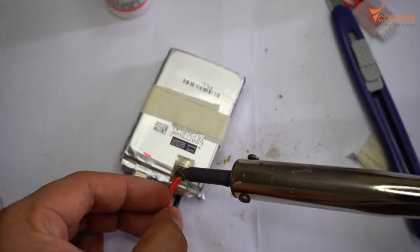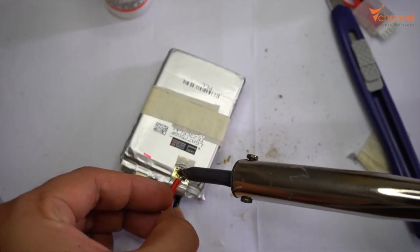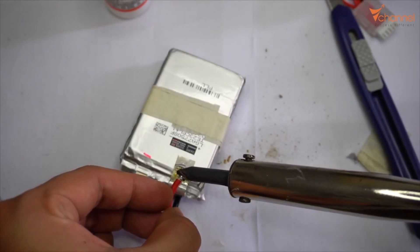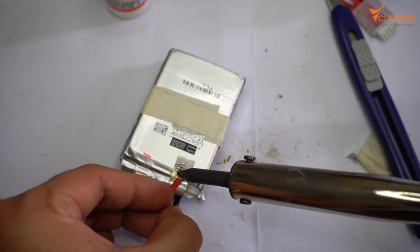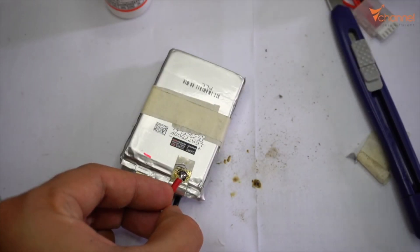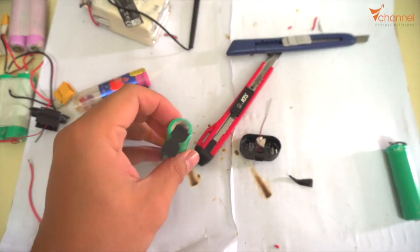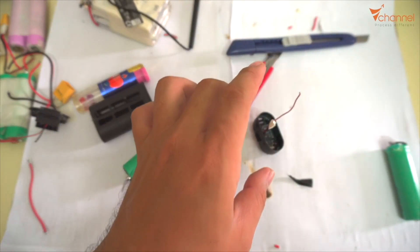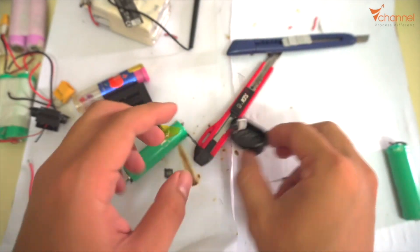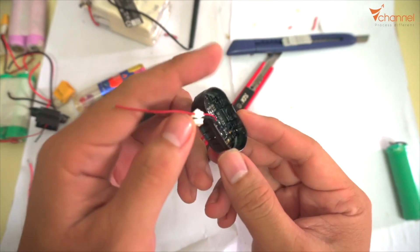If the chip cannot recognize the cell is being picked out, then we put in the new cell. But unfortunately, when it has locked — when we remove the battery without supplying parallel power continuously and pick the cell out directly — it will lock absolutely. At this time, even small models such as Mavic Mini, Mini 2, and Mini SE have this chip. It's not easy like the previous period, so you must pay attention to this.